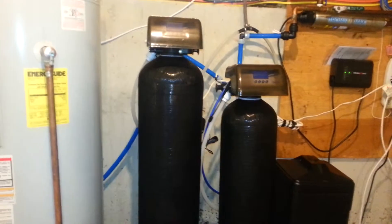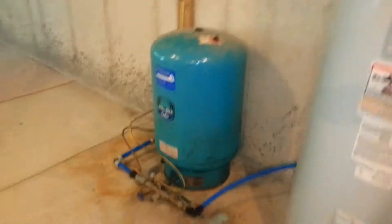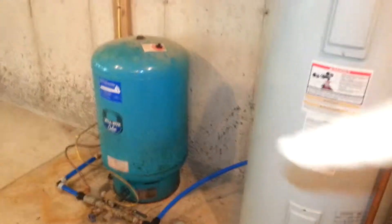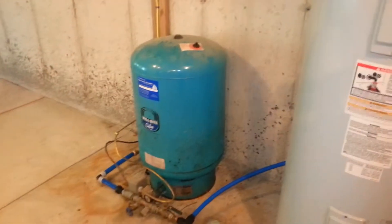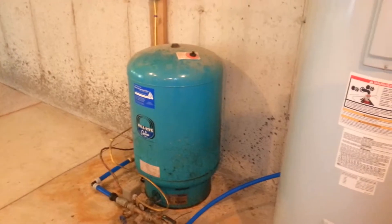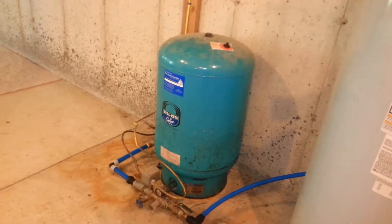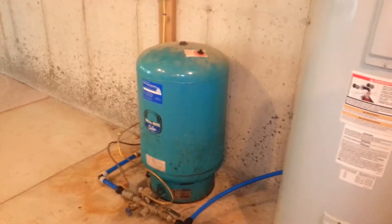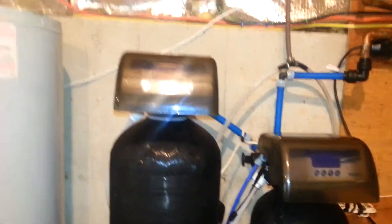The main advantage here is that when we aerate all the way over there and have plumbing that goes all the way to the first filter, that air mixing with the iron and sulfur and other things in the water will tend to drop them out of solution. If we aerate far away and give it a chance to start dropping out of solution along the way, it will get very clumpy and start to clog the pipes.